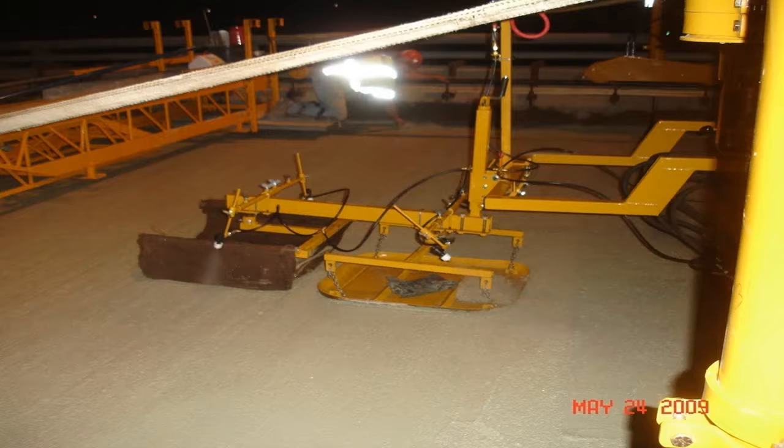If atmospheric conditions dictate, it may very well be necessary to apply a fogging mist. This is a technique where water is atomized and distributed to maintain the moisture level in the air before curing. The fogger should be attached to the finish machine to ensure a uniform and controlled application. Often you see fogging applied with a hand sprayer and serving as a finishing aid, which is not the intent, as that can compromise the surface quality by increasing the water content at the surface.